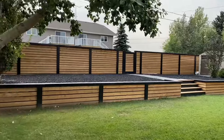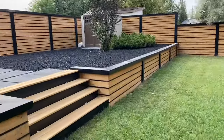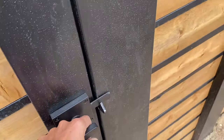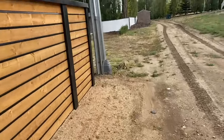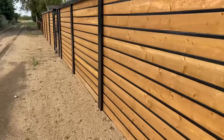This is sort of the whole backyard renovation — the pergola and everything. It was a fun project, a lot of work though. This one back here operates the same way. They got all the landscaping done in here — this surface is actually rubber, like recycled tires, which is really cool. Then there are patio stones leading to the back. I had to put a little brace on that one gate because it tended to sag a little. But the nice thing about this fence is it looks the same from both sides, so the neighbors get a good-looking product on either side as well. It takes a little more material to do it that way, but it looks good.